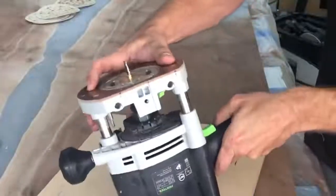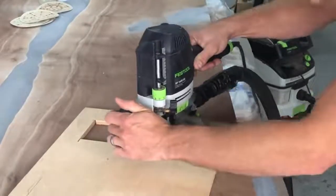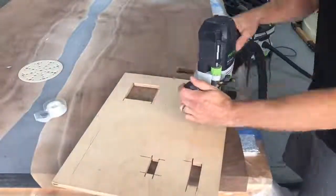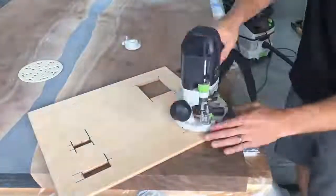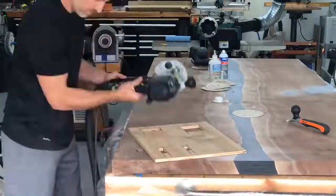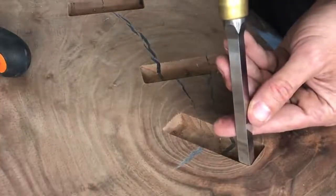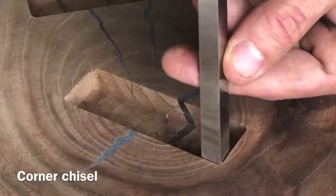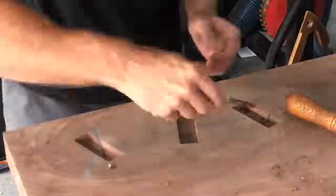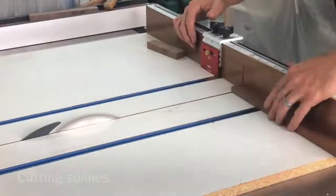Most of these cracks were pretty benign but I still wanted to play it safe and add a few splines. They're not going to be as strong as a bow tie and won't look as good, but this is on the underside of the table. I have a really simple jig — cut out a square shape anywhere there's a crack, about three on each side — and the epoxy holds them in really well so they'll help any small cracks from separating further. If you have questions on this jig or anything else, I'm super good about responding to every comment below, so feel free to ask.